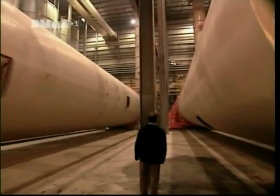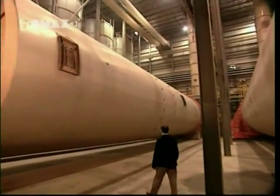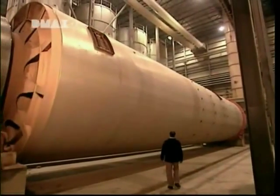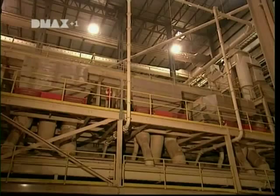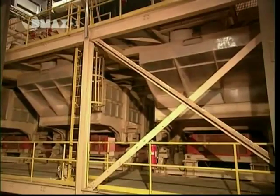From here, they send the dried-out particles to a screening machine, which will separate them by size. Pieces too big are fed through the mill again. Larger particles go into the rougher core layer of the chipboard, and smaller pieces into the smoother surface layer.